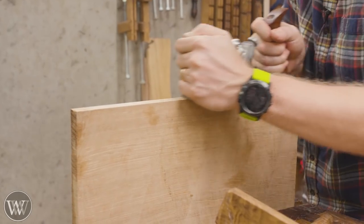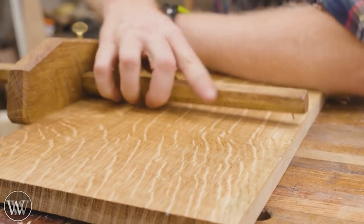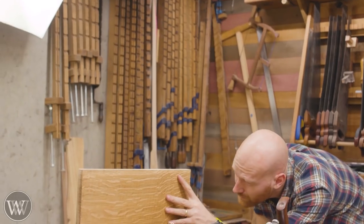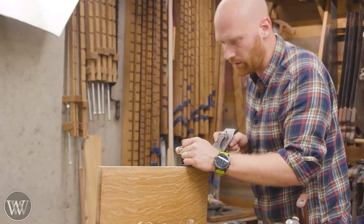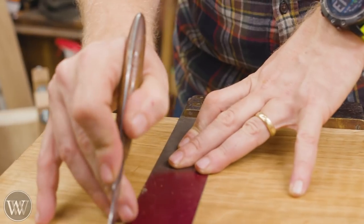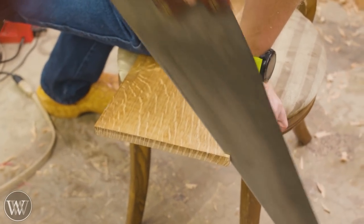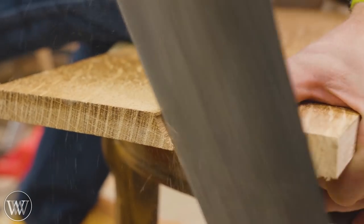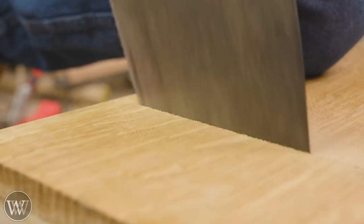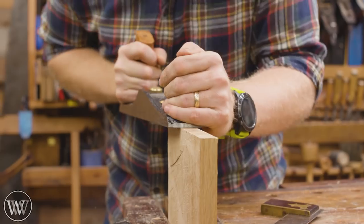We're starting with a one-way glass — it's mirror on one side and you can see through the other side. Originally I wanted to inset it into this one-inch thick piece of white oak for a frameless holder, but I found out later I need to make it a little larger. For the glass, I went to a local glass supplier — you can get it on Amazon but shipping makes it way more expensive. The glass store charged me about eight bucks and even cut it to size. We can cut the wood down to two inches wider and two inches longer than the glass.